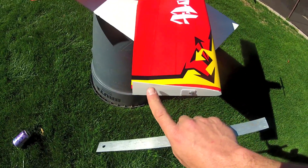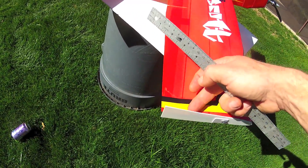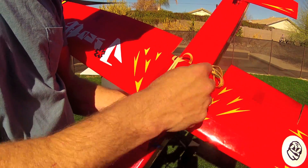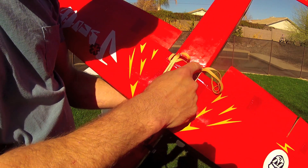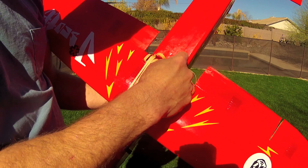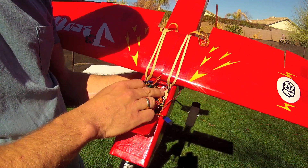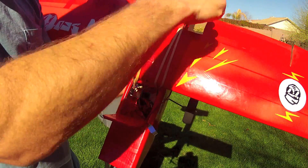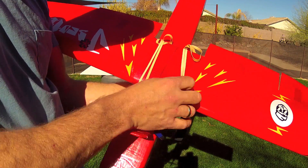These little winglets are made out of CD cases cut with two-sided foam tape attaching them onto the wing tip. The wings are held on by three rubber bands per side, total of six, and these are affixed in the rear around the carbon fiber shaft. It's simply located within the fuselage tube, not affixed by any means, and the carbon fiber rod comes to right here so that the rubber bands are simply left on the plane and affixed over the front of the wing.